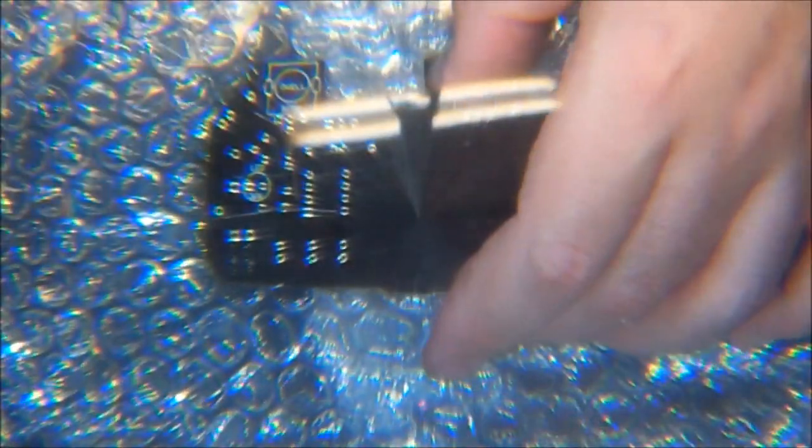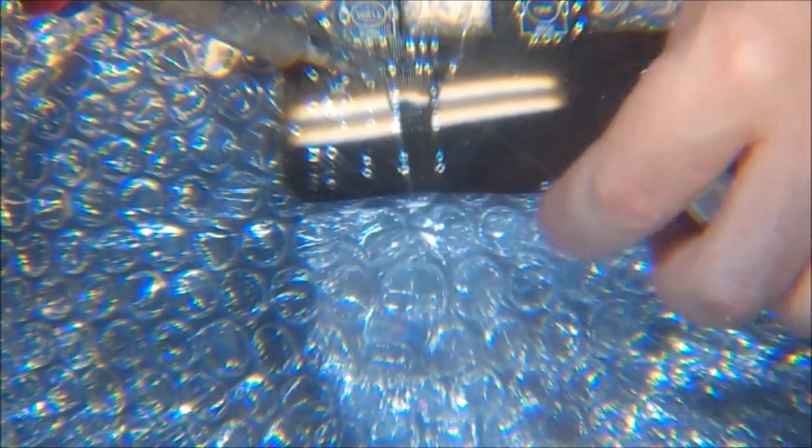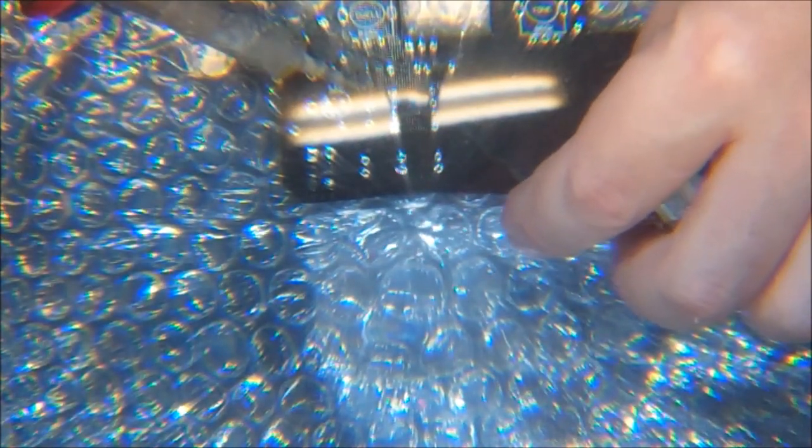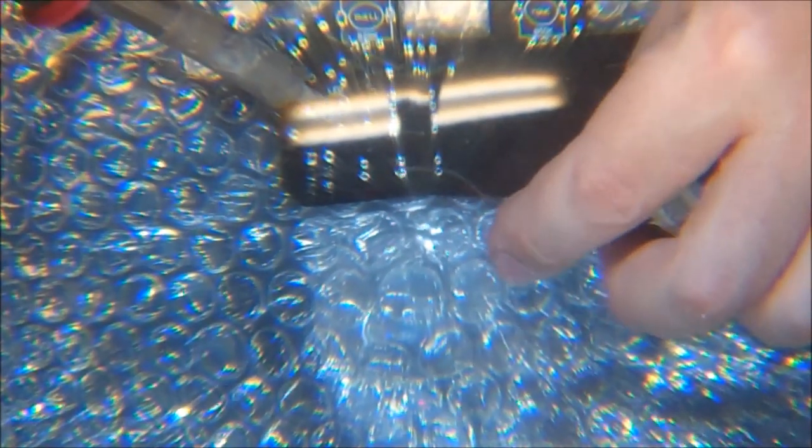Okay, so I now have all the resistors placed and we're going to begin the soldering process. I'm just going to solder a few and then clip a few leads just to make it easier to get to the things I need to solder on the next one. You know, take your time, double check. If you find that something isn't matching, like a particular resistor value you were expecting to find, you don't find, that usually means you probably put it somewhere else, and you should go find it wherever you did put it. Not that I just did that. Nope, no, I'd never do that. Never make mistakes here. Just cover them up well. But double check your work before you begin to solder this stuff down, and you'll be fine.